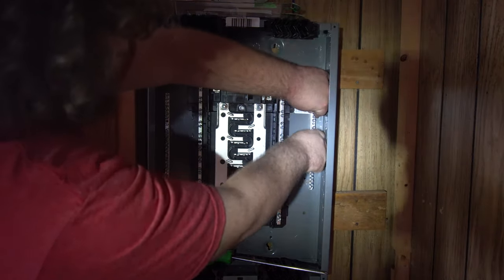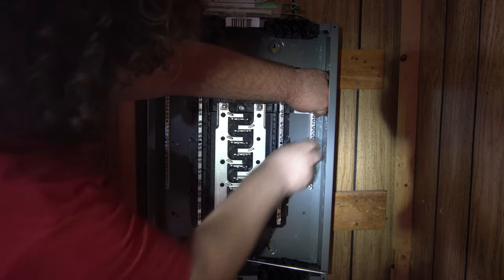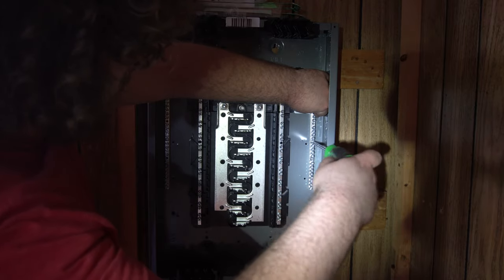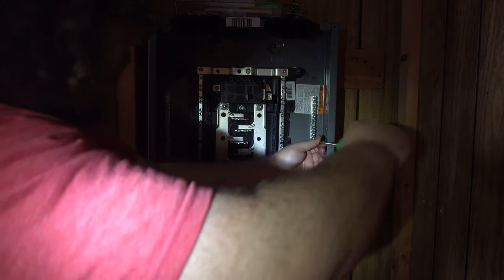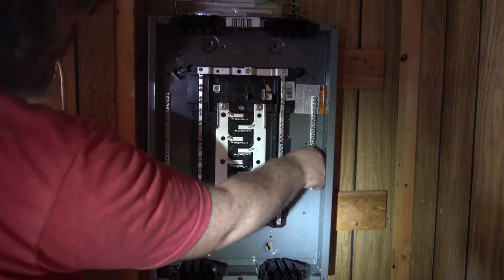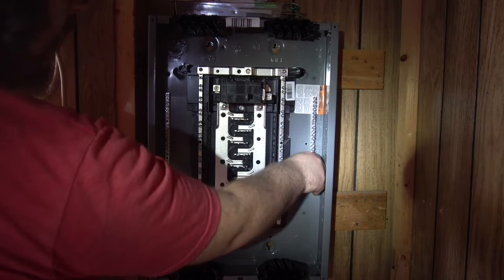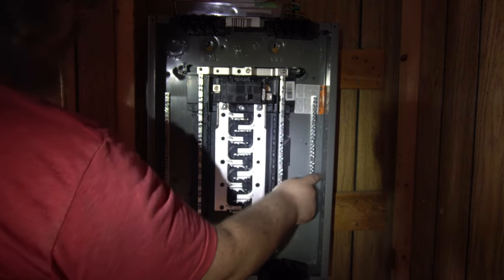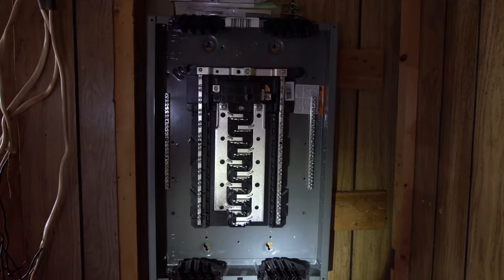Also forgot to mention that for those who don't know breaker boxes, this is made by a company called Square D, and they have two types. They have QO and they have Homeline. And I believe QO is their older system of breakers, and they're slowly phasing that out. So I made sure to get Homeline because there's more options, and surprisingly I read that Homeline's more expensive. But that wasn't the case for me. QO was actually more expensive to get a bigger panel to save some breakers.